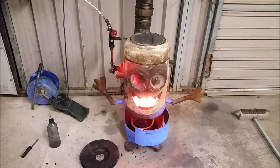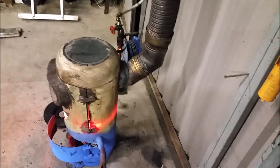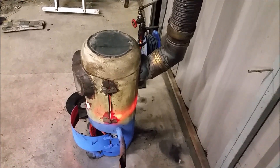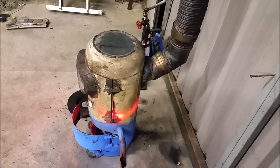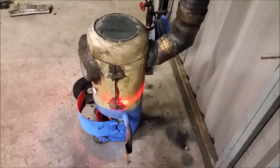Okay, hello everyone - back in the shed again, no surprise. I've been messing around with the stove again. I changed the flue because I wasn't getting enough draw, and I wanted to try something different. I couldn't increase the flow without it getting very smoky and without getting any appreciable extra output.